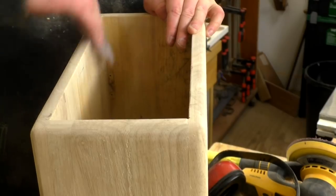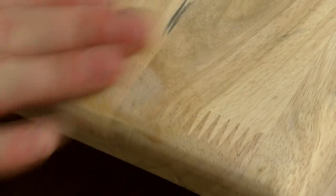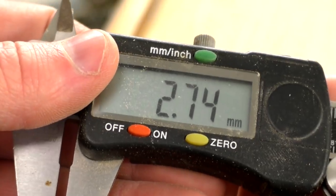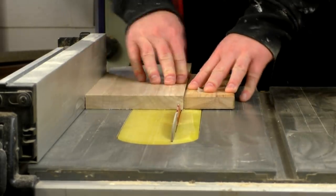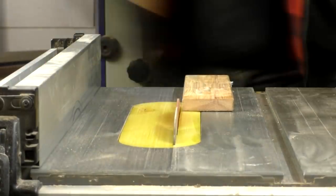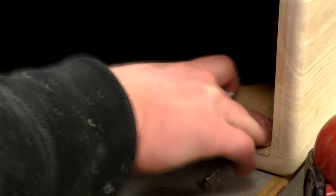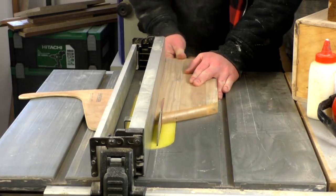The inside edges were sanded by hand as were the rounded corners. I used some wood filler to fill any small voids and sanded that back. The drawer front had a slight lip at the bottom so I measured that with the calipers and used them to mark up the thickness I needed to rip at the table saw. I lined that mark up with the blade and set up a temporary fence using some hot glue to allow me to cut two equally thin strips for the bottom runners. I cut them to length at the bandsaw and then glued them in place weighing them down until the glue set. I also measured up for the top drawer runners and cut those in the same way, to be added later.